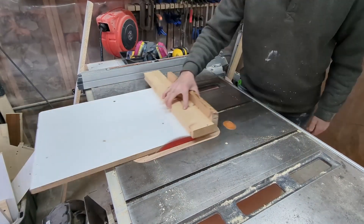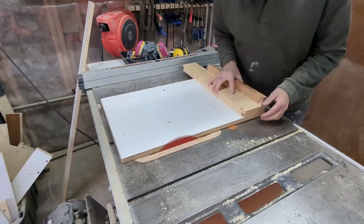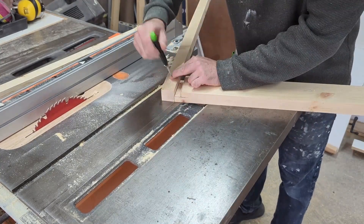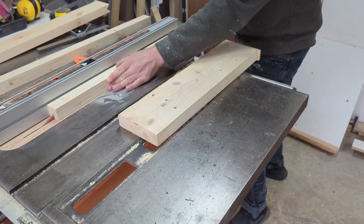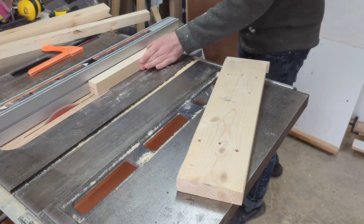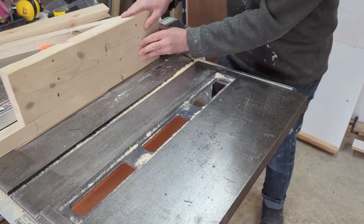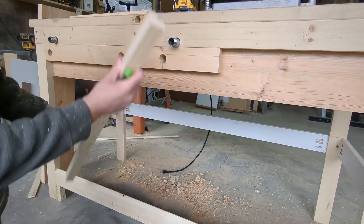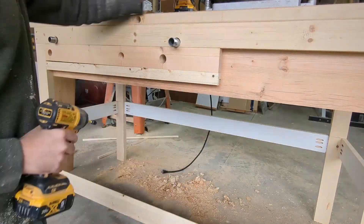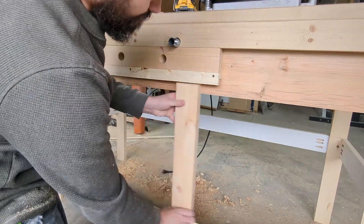Traditionally, this rabbet would slide into a groove that you cut on the underside of your bench top. I'm cheating the system and cutting a mating rabbet on a cleat that I will screw into place instead. Simply use the rabbet you cut on the sliding dead man to mark where the rabbet should be cut in the cleat that you're going to make. You don't want too tight of a fit as you want this sliding dead man to move around, but you also don't want it so loose that it pops out of position. With these parts cut, we can simply screw the first cleat into place on that 2x10 we installed at the beginning of the video. You can see that the cleat is positioned with the groove on the back so that the sliding dead man is now locked into place between our angled stretcher and our slot above.